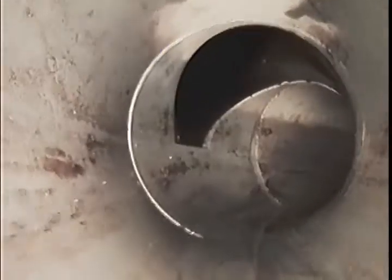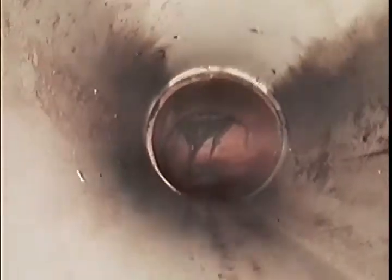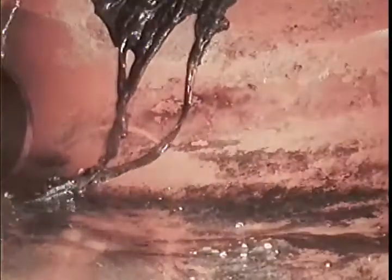We're at 5 meters. Joint there, looks alright. It's holding water a wee bit there in the bottom, you can see that. We're down 13 meters. Joint, that was alright. We have an inspection bend there, so we turn into the right where we join on to earthenware junction there.